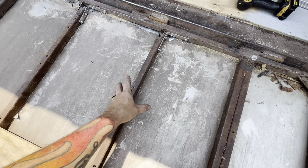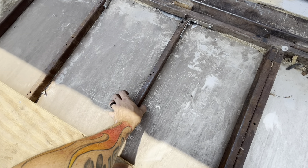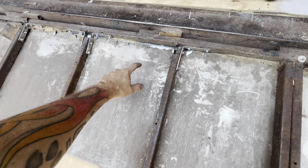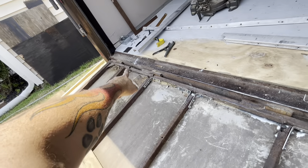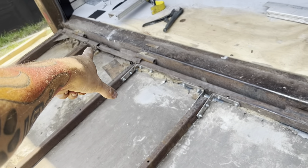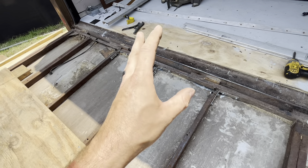Basically attach some new metal to good old metal. Just like building houses — if you're remodeling, you've got to get out of the rotted wood. If you're going to attach something to rotted stuff, you've got to at least get out of it and come into the good stuff before you can make a connection. There's no strength at rusted, rotted stuff. So new metal should have been put in. I would have took my cutoff wheel and cut this back a little bit on each of these, then come in with a fresh piece of stock, through-bolt it where the metal is decent, scab your legs to that, use 90-degree brackets in every corner, maybe a T-bracket across the face, then put your wood back on it. That would be an excellent repair for a DIY with no welder and only a reciprocating saw.